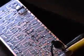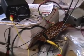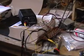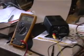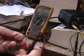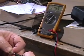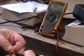What we found, and this is going to really thrill you, is that the capacitor isn't shorted. It's just plain leaky. I mean, really screwy leaky. There's the ohmmeter scale. This is the capacitor we took out. It should normally read at least 20 megohms or more, and it measures a mere 183 or 200 ohms or so.